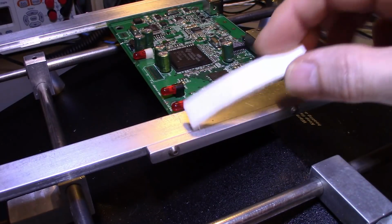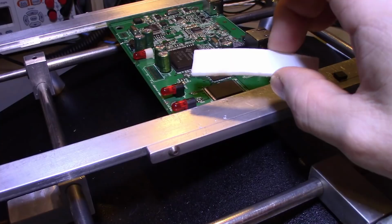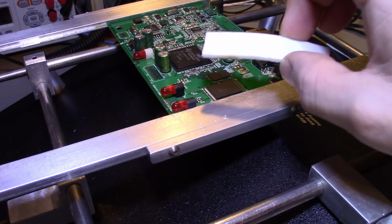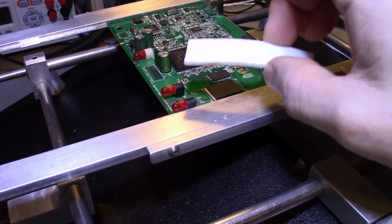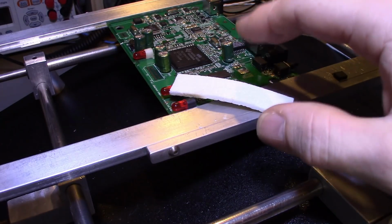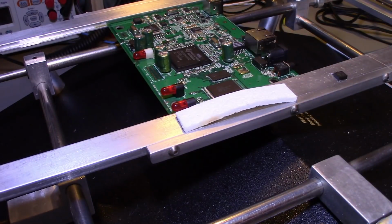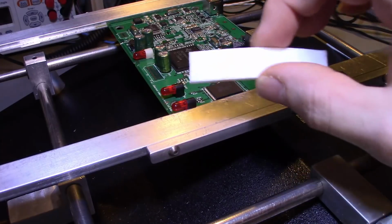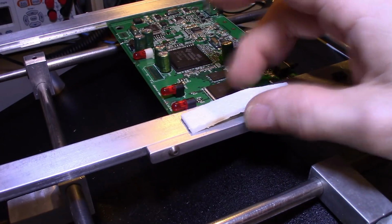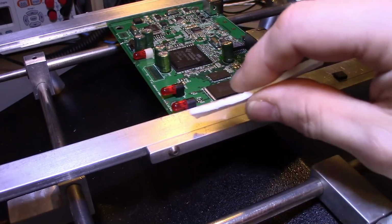They're not selling you the tiny pieces. Most of those companies sell products for furnaces and kilns and really high temperature places. So if you can't find it where you're at, try to find a company that sells products for furnaces and kilns. They're going to have this type of stuff, because this is what they use inside kilns and furnaces: ceramic mats. Like I said, just make sure it's thin.